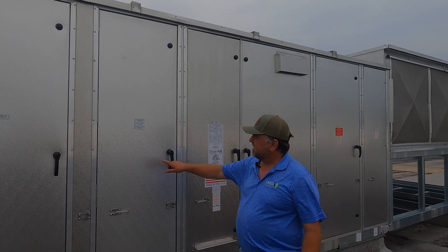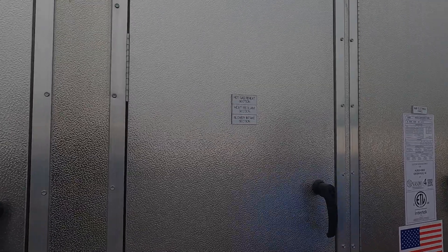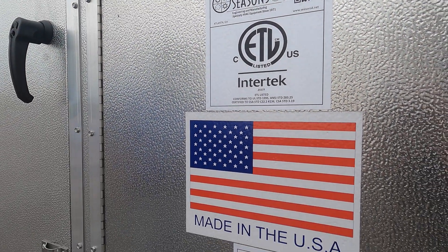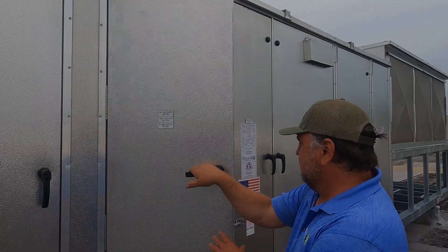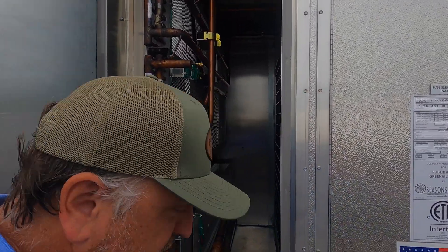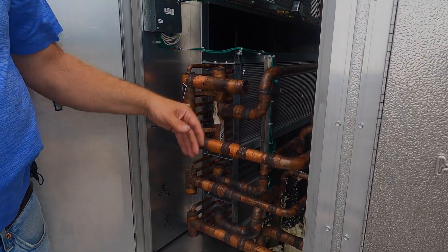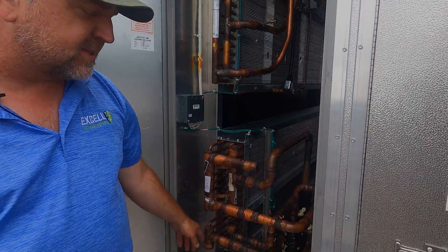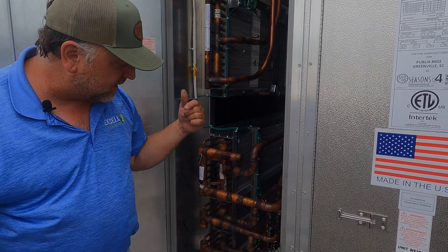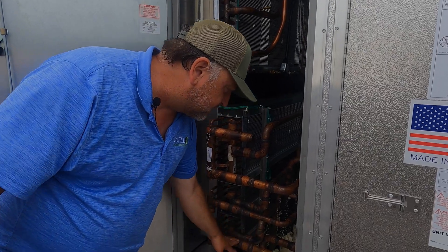It's piped to our main AC over here, goes through a coil, and comes back up. Here's our AC for this — as you can see it says 'hot gas reheat section, heat reclaim section' right there. Brand new unit, just installed. If we open this door up, these are our reclaim coils and you can see we've labeled which rack they come from. Hot discharge gas is coming from rack three into our coil and coming back out.